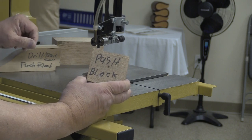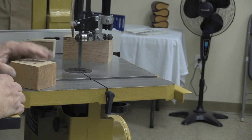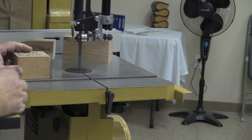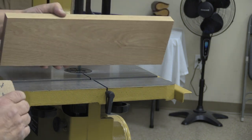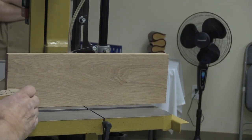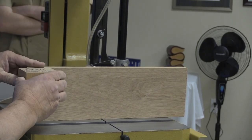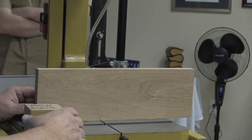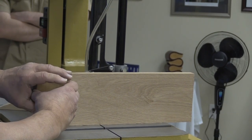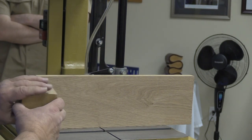But what I'm doing when I'm pushing it, let me turn the saw. Okay. I'll put it on there and get it on the edge of the board like here. I still use my block, but I hold on to it just right here, and I can push it a ways into it. But when it gets near the end, I'll put this on here and just hold it, and all that lip has to do is hold it in place while I guide it with my other hand. That way I'm nowhere near it.